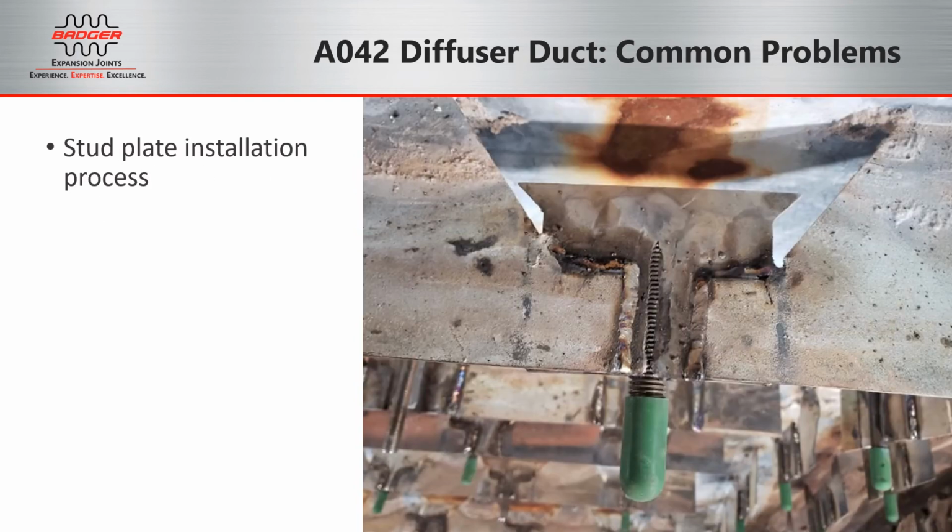Replacing the studs is a key area where we feel we can make an improvement on the OEM design. On the OEM scallop bars, the studs were only welded on one side and was a common point of failure and cracks, as you saw from previous pictures. On our refurbishments, we can attach the stud to a stud plate in the Badger shop. Then that allows us to bring that in to the site for an easier and quicker weld onto the scallop bar, and also provides a much more robust weld with less chance of cracking in the future.